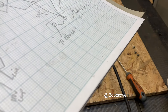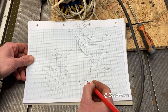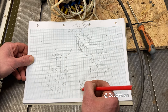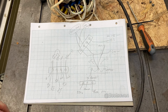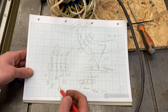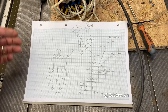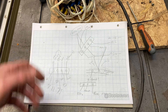With a pencil: the switch has three positions - element in the center, one going to position 220 volts, and one going to fuse then 110V. Power comes in, and instead of going to mid-switch it goes to the 220 switch. That fuse is still the fuse but it comes from the fuse on to this side of the switch. Simple enough really - and maybe that'll help you. I can't imagine many people set off to fix one of these that's been doctored like this, but there's a wiring diagram.